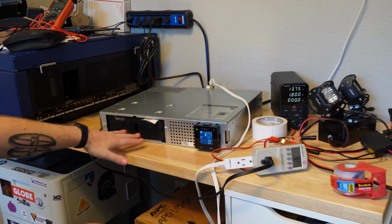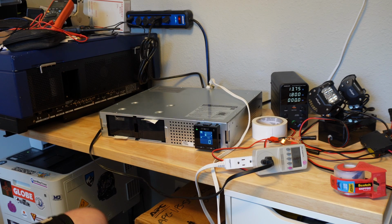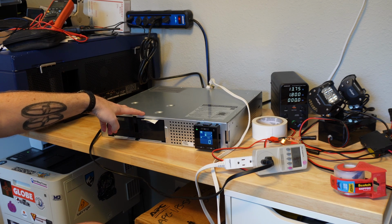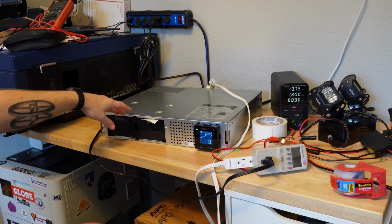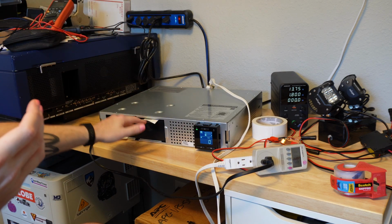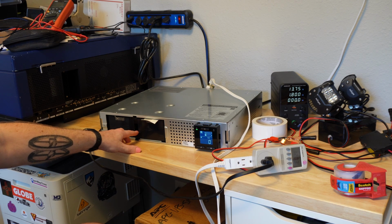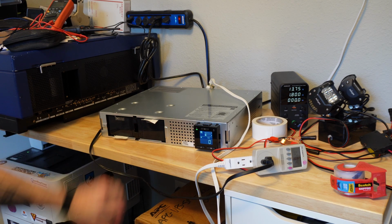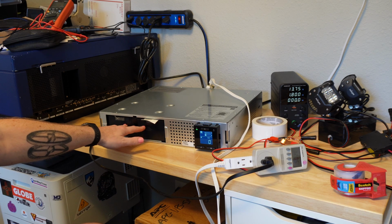Obviously, and I should mention this too, because it might come up. When I opened this and the batteries were super low, my very first thought was, does this have an internal fault that caused it to discharge the batteries when it was off? But, and anyone who buys these all the time would know this, and obviously I know it because I hooked them up and then I just forgot, in the box the batteries were disconnected. So they weren't connected to anything, and they ended up at like 2 volts and 7 volts or something open circuit.